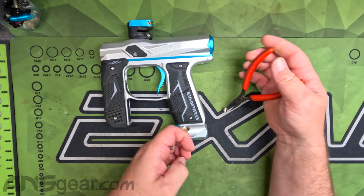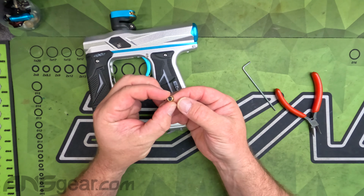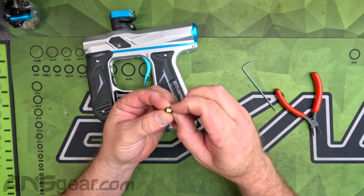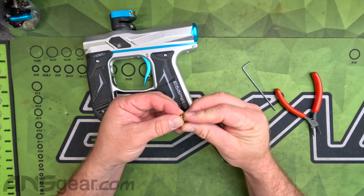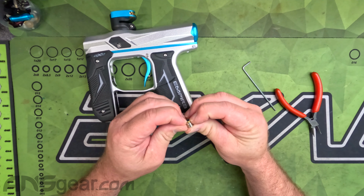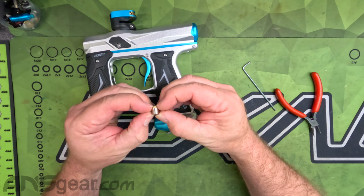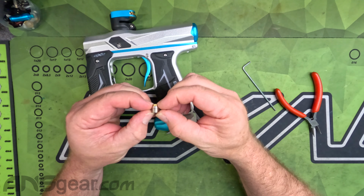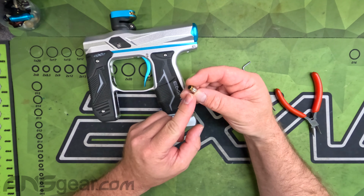underneath here, you got a spring and this little cap. This spring goes in there. This goes down inside here like this. So this sits, and you can see with the spring here, it can move up and down on itself right there. Boop, boop, boop, boop. So when this is inside here, this spring is pushing this cap out, and this cap has a rubber seat on it right here, and that seals up against the bottom down there.